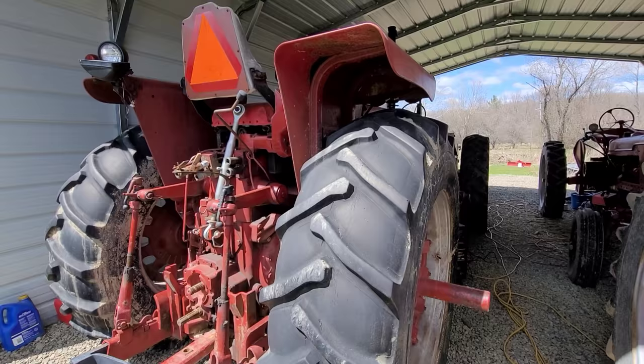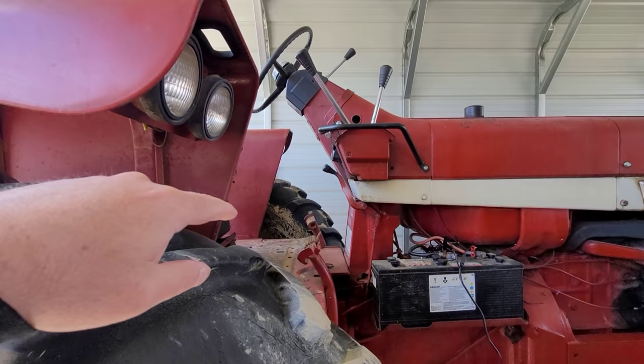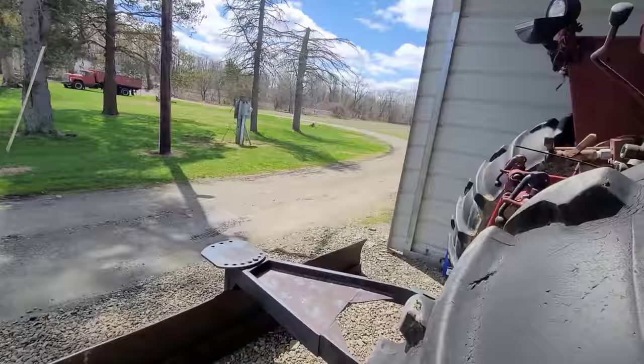Well, I fished around a little bit and realized my problem isn't as bad yet as it's going to get if I don't tear into it and tear it apart. But today what I want to do is add about a gallon. I'm just below a gallon low on this hydraulic fluid, and hook the 311 plows up to this and go test the ground out. See how wet or dry or somewhere in between we are.